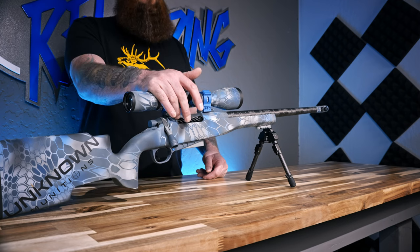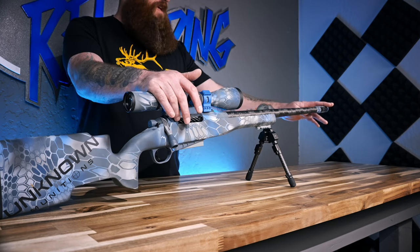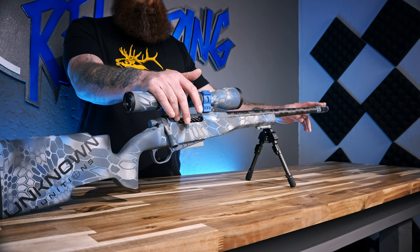This is the world's only 7PRC rifle built on a medium action. Starting off at the tip, we have a Pro 5 muzzle brake — this is a 0.990 diameter self-timing version. Another Carbon 6 barrel, 22 inch, eight-and-a-half twist, Sendero profile.